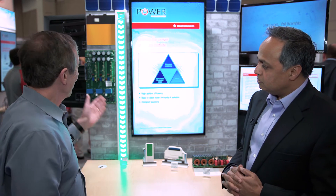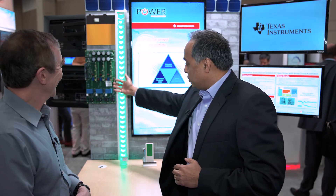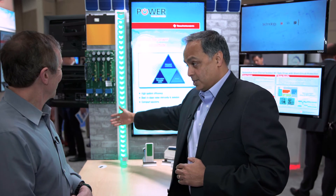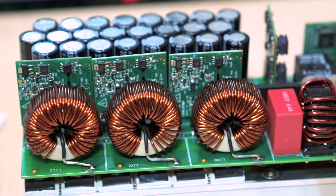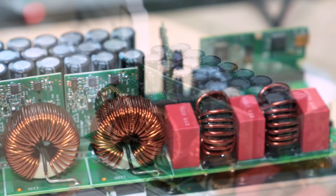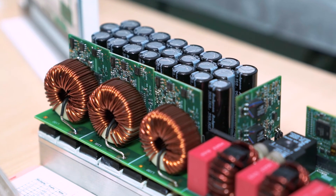Now, if you were going to do this inverter in silicon IGBTs, how big would it be? That's a very good question. What you're seeing here is for silicon carbide. If you were to use IGBTs, it's twice the size — you can already see the compactness. Likewise, the on-board charger is also twice the size. So that's a big deal, especially when you talk about a car — weight, size, everything is important. That's a clear show and tell of why silicon carbide and TI drivers are key.